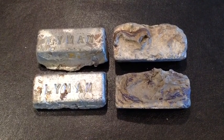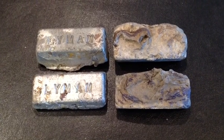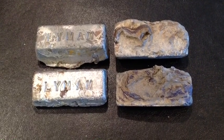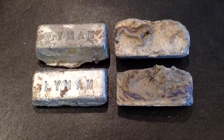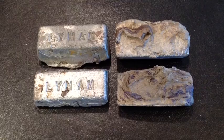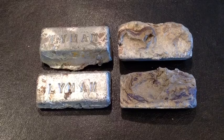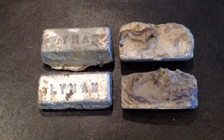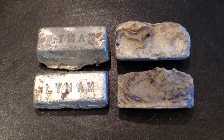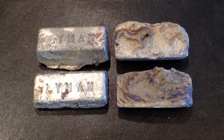I kept skimming and skimming and skimming. Then I tried to pour some ingots with lead that looked like it might be okay, but this is the best I could do. You'll see that cruddy, curdly icing-type zinc is actually part of the alloy now. The zinc ruins the alloy and you can't get it out — it's right there in the lead. Even in the deepest part, the undersurface on the two ingots on the left just doesn't look good. You wouldn't want to cast bullets with this. I wound up throwing away the whole pot because it was ruined as well.